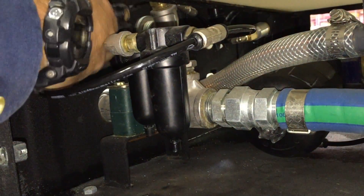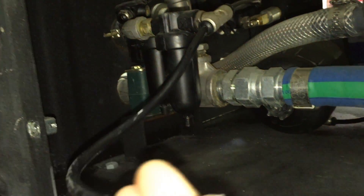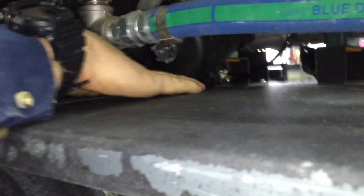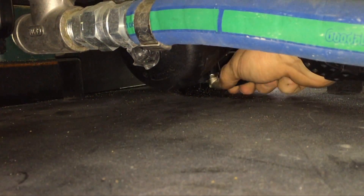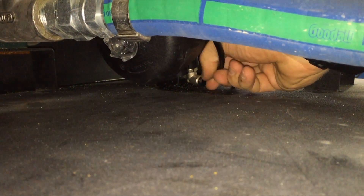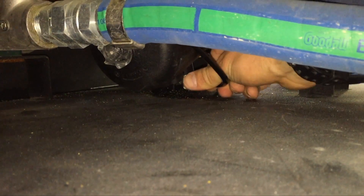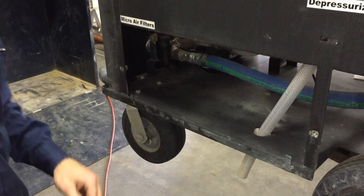Get the other side of it here — we have a fitting and a line on the front of the diaphragm, and that is our opening port. Take that line off, plug the other line into it. The line taken off first is just supply air; this line is going to open the diaphragm so we can get the bolts out without the pressure of the spring. Once that's all hooked up, turn your compressor air back on and you can move on to the next step.